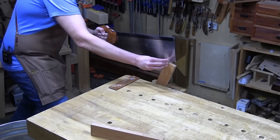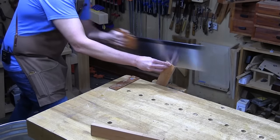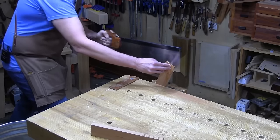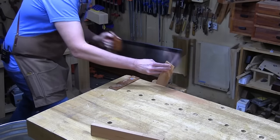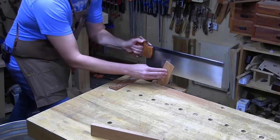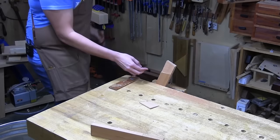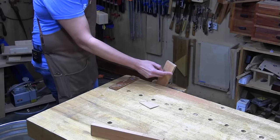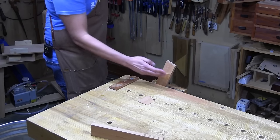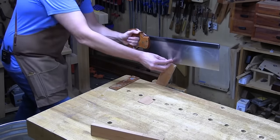I'm sawing, keeping the middle — going to saw to the right side of the line. Now we're back to principle number two: long saw strokes, let this saw saw, don't force it, don't be erratic, be smooth, let the sawdust clear. And now principle number one — I can see I'm a little ways away from my line. I can also see the cheek hasn't come away yet... and now it has. I've got a fantastically wonky cut to the point where I almost ran out of material on the far edge. My tenon shoulder is a scalene triangle; it's at an angle, the whole tenon cheek is canted off to the side. I double check my alignment, double check my stance — I feel good, feel comfortable.